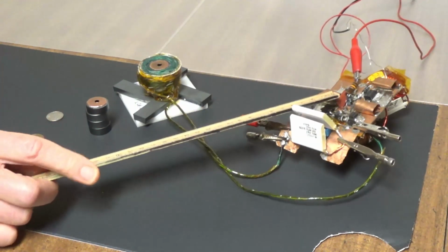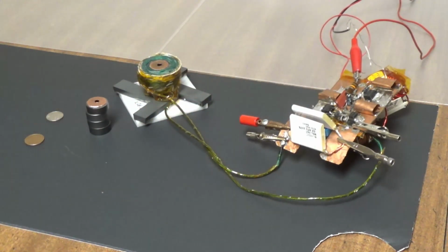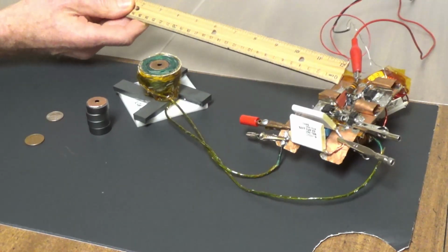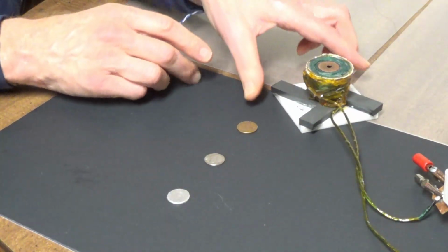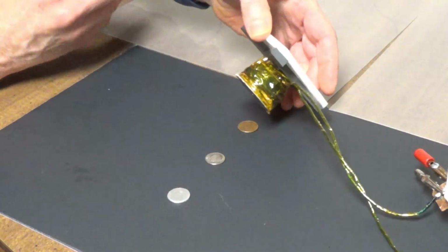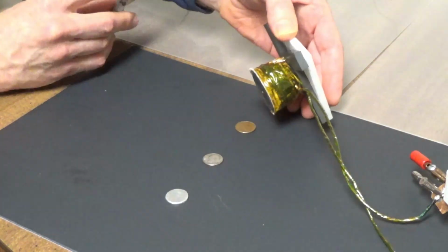And so this is a ZVS oscillator, like you see a lot of induction heater circuits. This happens to be a homemade one that I had laying around already, had modified a little bit. But that just drives it with about 9 kilohertz instead of the 60 hertz. I have a switch here to turn the magnet on and off. It's an electromagnet. And then the pennies are actually the hardest because this is sized a little better for dimes.